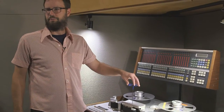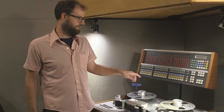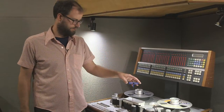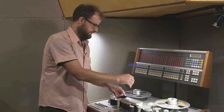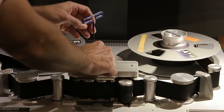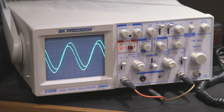I'm looking over at the oscilloscope and adjusting so that both waveforms line up with each other, using the outputs of track 2 and track 23 going to the oscilloscope. Now I'm going to go to the sync head — that's the hole to the left for the record sync head — and I'm going to adjust that very gently.